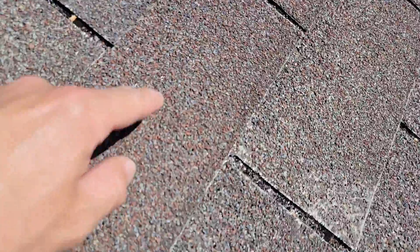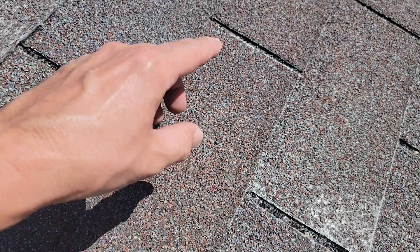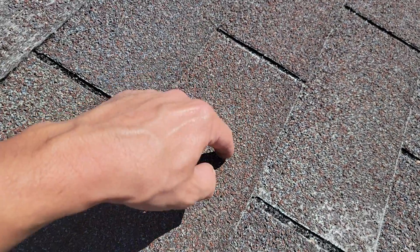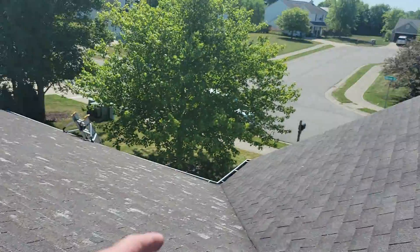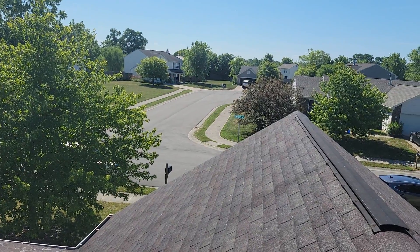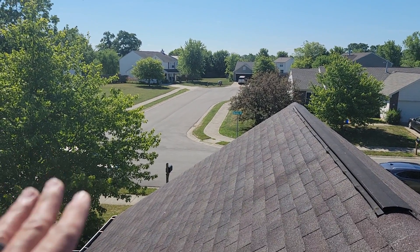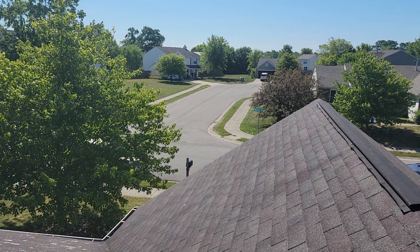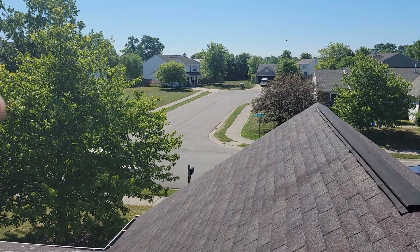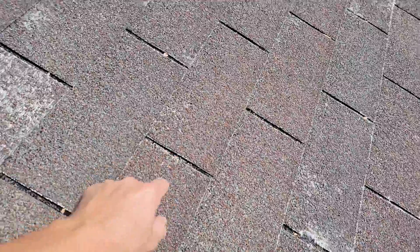The asphalt is covered with granules - not just to give it color, but they serve a very important purpose of protecting the asphalt. The sun beating down and getting to the asphalt is going to degrade it and wear it out a whole lot quicker. Just like your asphalt roads out here - they change color from that dark night-black to fading over time, then start cracking from freeze-thaw cycles, water getting in and busting it up. The sun is actually a big contributor to breaking down the asphalt, and it's the same with the asphalt in your shingles.